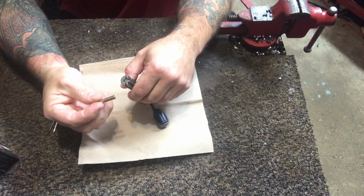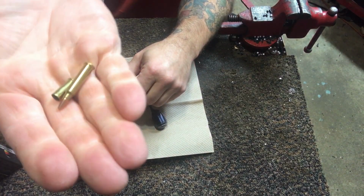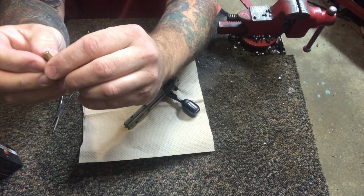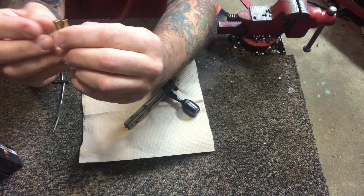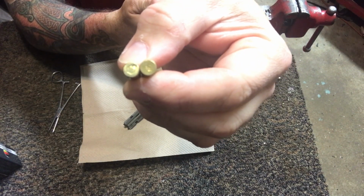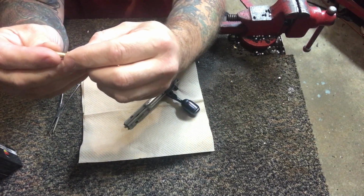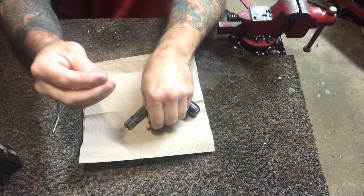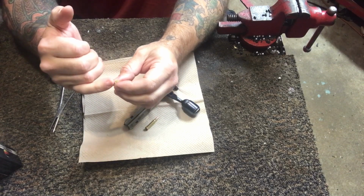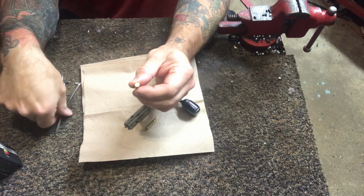So as a result, the 455 and 457 have to have a firing pin that is able to accommodate the larger 17 HMR and 22 Magnum, 22 long rifle. So what that means is that the firing pin is not built for just the 22 long rifle. It is built for the larger case of the 17 HMR and 22 Magnum as well. And so as a result, the firing pin imprints farther off the rim into the thicker non-primer impregnated part on a 22 long rifle case.